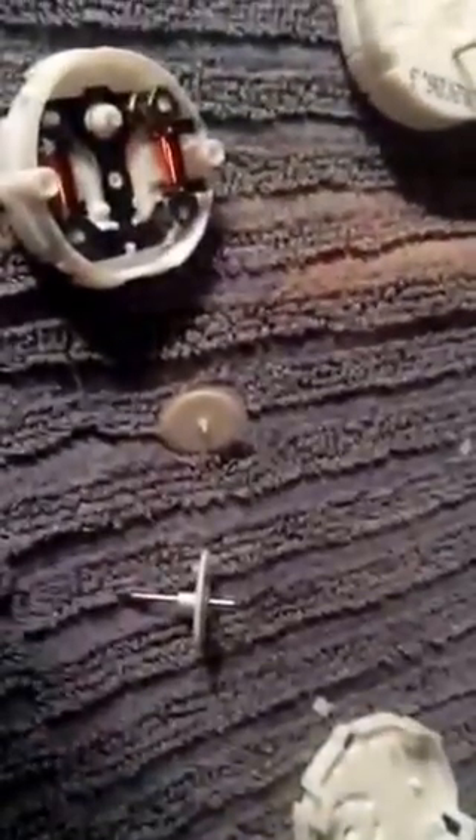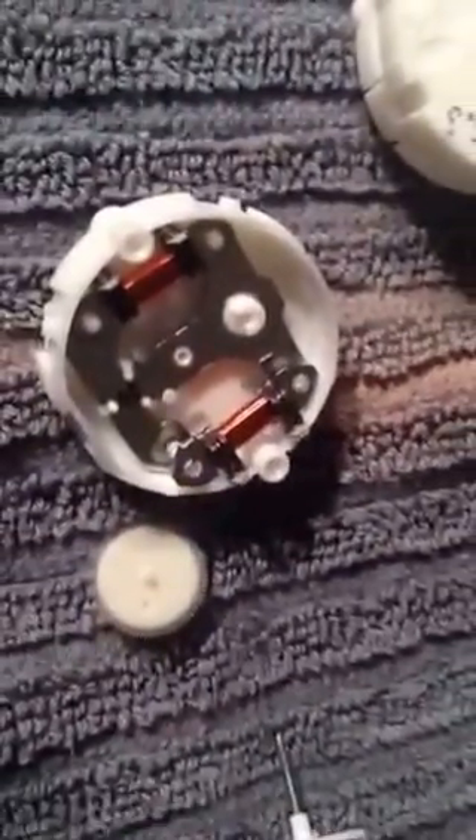So you remove all these — now listen to this, it sounds like a rattle. All these rattle — those are bad. The new ones, there's no rattling at all. What's on the inside of these things is just a bunch of little plastic gears. Mine started going out around 145,000 to 150,000 miles — it's no wonder, hitting bumps constantly. You can see how fine the mesh is on those gears; no wonder they wear out.